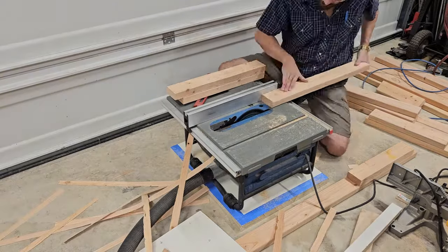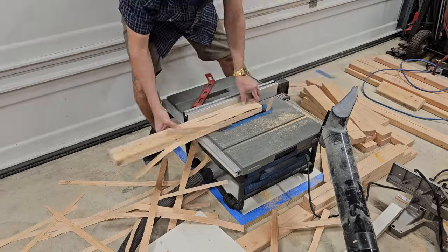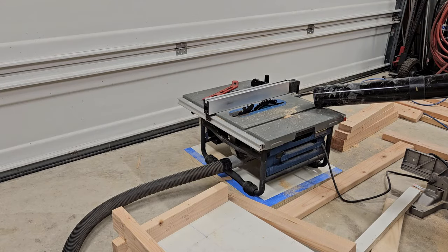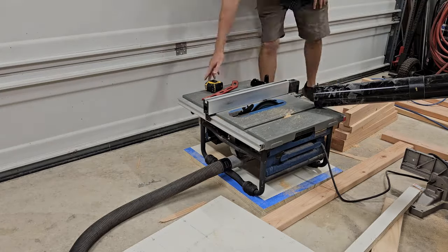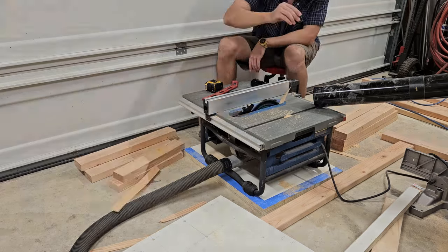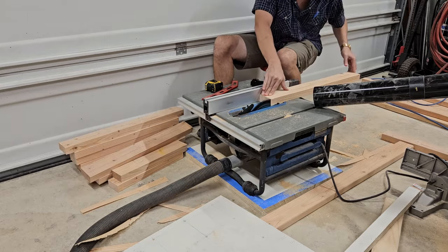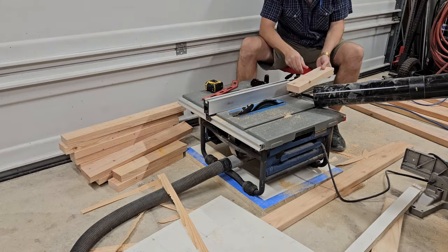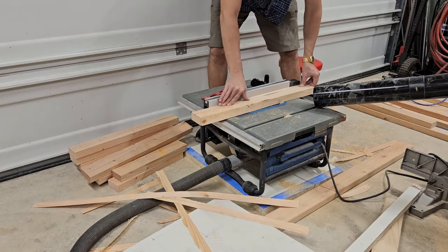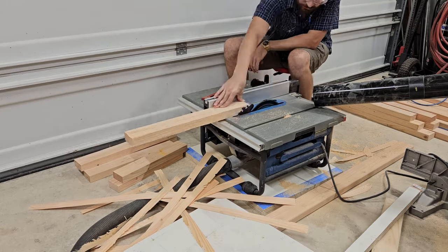On screen I've now got all my framing outline pieces cut to length. I'll grab the table saw and start ripping those down to the width I want, to get rid of those factory radius edges and begin to disguise the factory two by four look. I took one eighth of an inch off each side, then another one eighth, ultimately needing a full quarter inch off each side to fully get rid of that radius edge. What we end up with is boards one and a half inches thick and three inches wide — down from three and a half inches wide when we bought them.